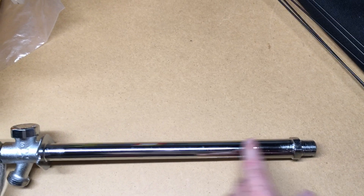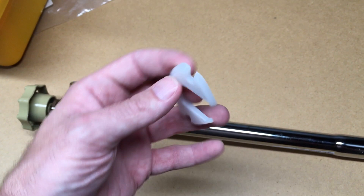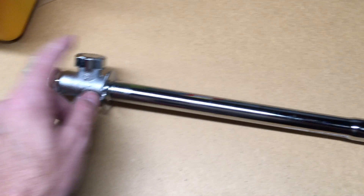Being that it's 12 inches, it gets it into the house — the valve is way back here, so the frost would have to travel quite a ways to get here. They make these in shorter ones too, but I say use the longest you can. This is safer. It also comes with a little plastic angle piece so you can put it up against your siding — I have brick so I won't need that. It just clips in right behind there.